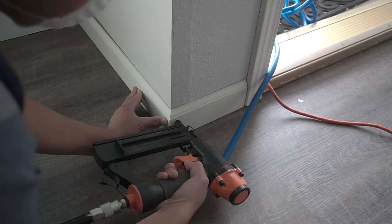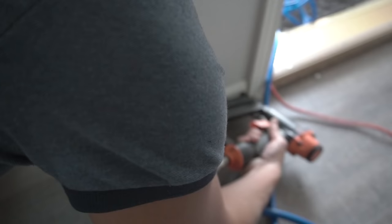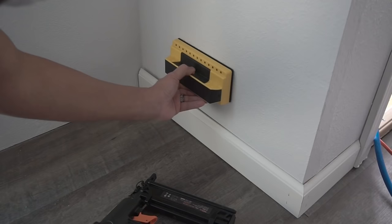This end I'm going to keep on a flat straight cut because I'll show you a little trick later on. Now we're going to nail it first — two nails on both sides — and then nail it at the ends. Don't over-staple it. Another trick I like to use is my stud finder to find those studs so that you know where to nail your brad nails to the wall.